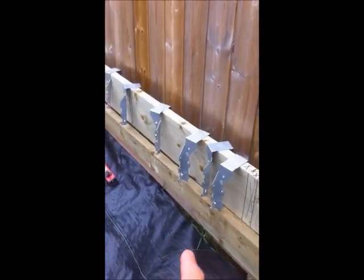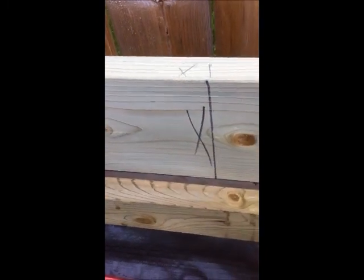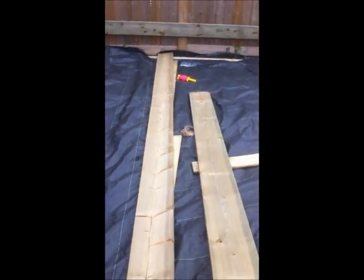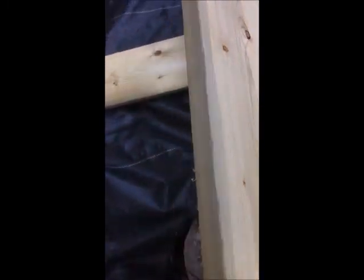There's going to be a doubler going all the way across, and we're going to frame in an opening right here for the storm drain that's underneath the landscape cloth — we'll be cutting this open so you can have access to it. The temporary piece here holds the joists in place as I lay them down and nail the other side. In the center there's another beam constructed from two by ten stock, sitting on the sono tubes with concrete footings.